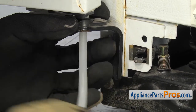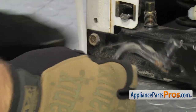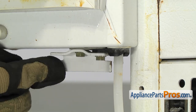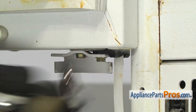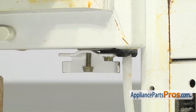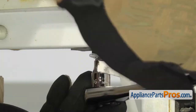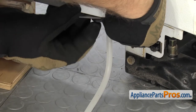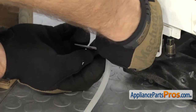Then we're going to pull down on the hinge and pull it off the water line. Now that we have the hinge off the frame, we can take all this stuff off the door. We're going to use our 5/16ths socket to take off the bolts that hold on the doorstop, the cam riser, and the riser cam shim. Make sure you hold the door so it doesn't fall off while you're taking the bolts out. Once you have the second bolt out, you can pull it out and set the bolt and the door closer aside. Make sure you don't lose this shim. Then we can pull the cam riser and the riser cam shim off the water line.